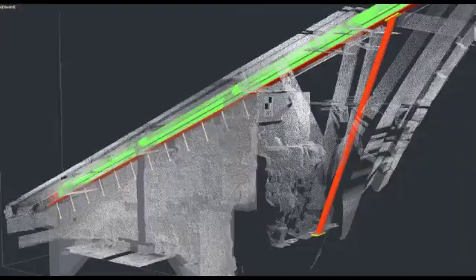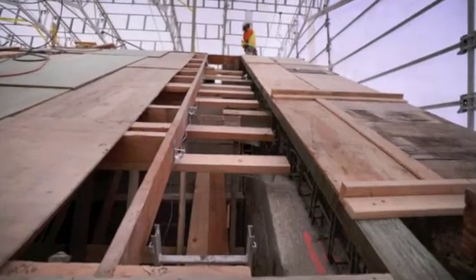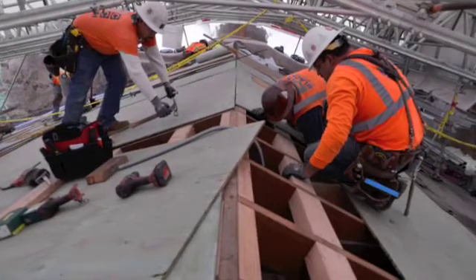There are several reasons that the laser scanning was helpful for the detailing of the wide flange beams above the catenary arch. Our BIM department was able to forecast some deflection and crown in the roof that we would not have otherwise seen. By forecasting that, we were able to make adjustments in elevation to the beams and make adjustments for straps to receive other members. We were also able to fabricate those wide flange beams before any roof members were taken apart or any of the demolition was done, which was a huge time savings in the field.